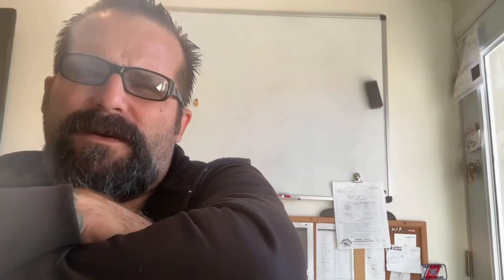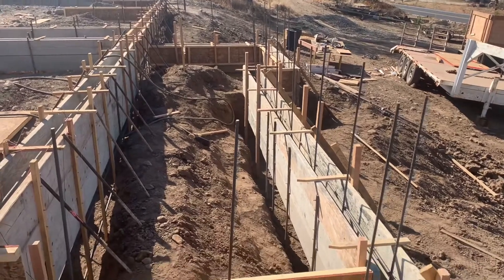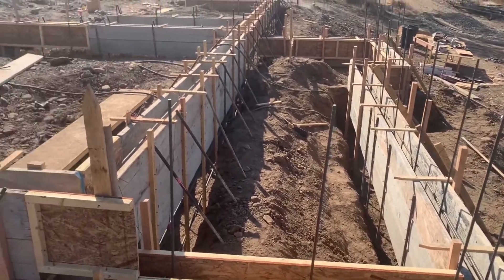On the front of the house, there's a stem wall that goes from the foundation up to the floor joist, and the front patio gets poured up against that. I'm going to have to pour the front patio in two pours for the stem walls because of that. We had to leave some vertical rebar sticking out of the top of the front stem wall for the patio.